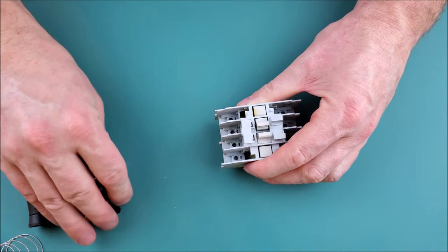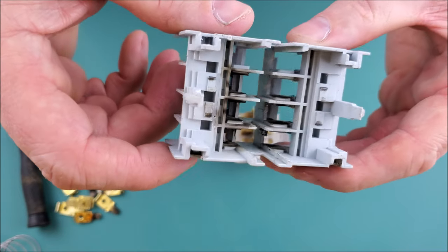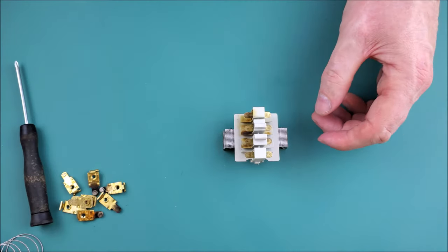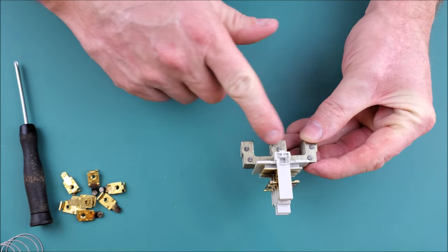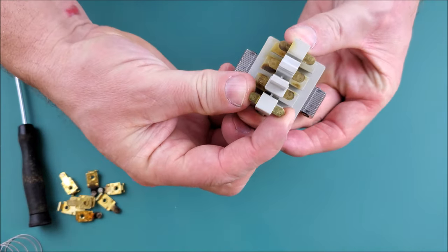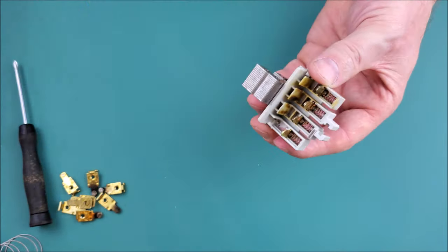With the conductors removed, I can lift off the upper assembly — a plastic housing with some carbon buildup on the edges from arcing during service. What remains is the armature: the metal core piece with an attached plastic body that holds the upper contacts. These are what pass current from the line side to the load side whenever the contactor is energized. Removing the spring and turning them sideways lets them slide out.